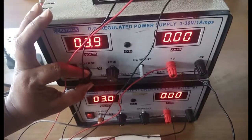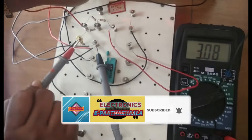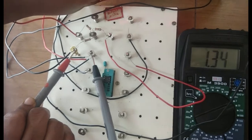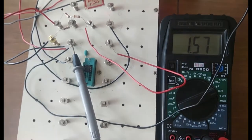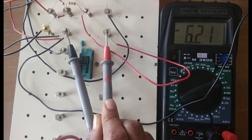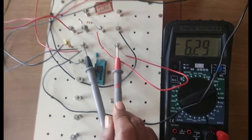For the second case, I will change V1 to 4.5 volts and V2 to 1.5 volts. So 4.5 plus 1.5 equals 6 — you should get around minus 6. You can notice that minus 6.2 is shown. That means it is verified that the op-amp can be used as an adder.